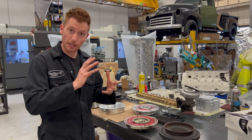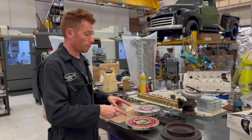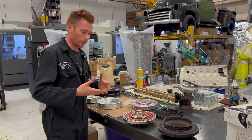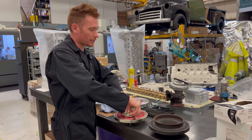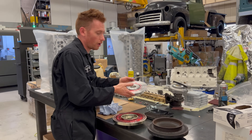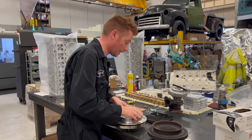It's literally suspended by a series of O-rings. That internal counterweight, which we've calculated, basically helps to take out the harmonic shock in a similar way to the rubber damper, but the difference is that it's inside. When this is all assembled, that weight is totally encapsulated and won't deteriorate from weather, heat, cold, or anything like that — because it's fully sealed in its own little chamber.